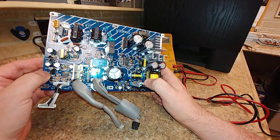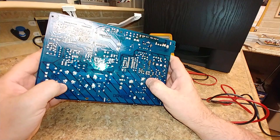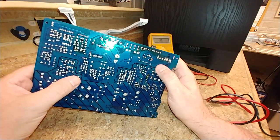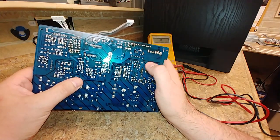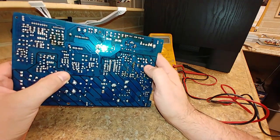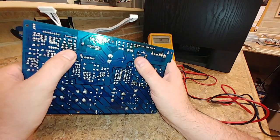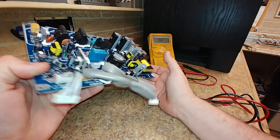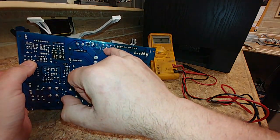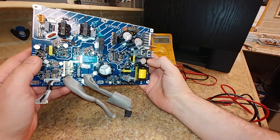The ICs look good on here — they don't look messed up at all. I really don't see any cracked or dry solder joints that could be causing the missing voltage. When you see a cracked solder joint, sometimes you need a magnifying glass to see it depending on your eyes. What happens is expansion and contraction from heat actually makes the solder crack around the pin on the component terminal, and that could end up giving you problems — it may work, then start heating up and fail on you.